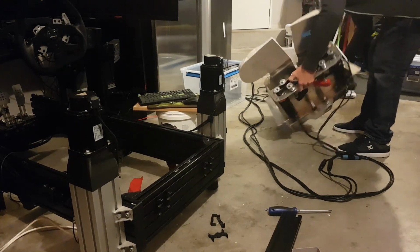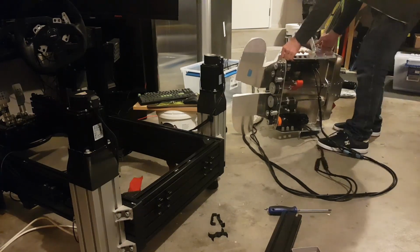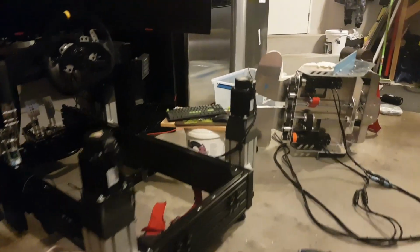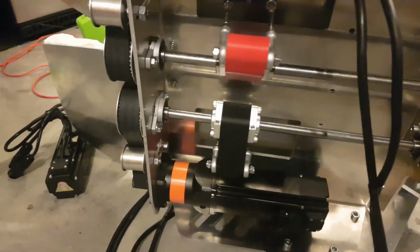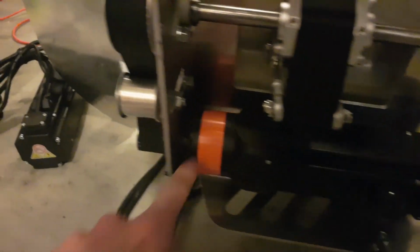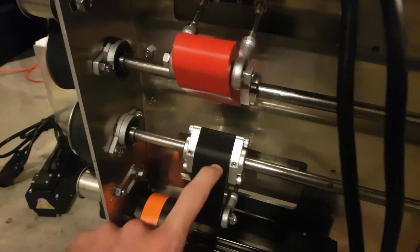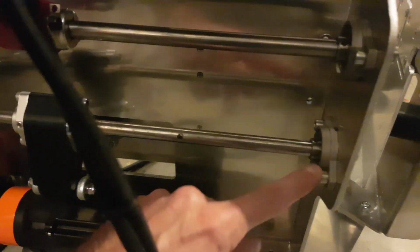So, just one outside, and then we can get to work on it. Yeah, that gets all nice and open. What we're going to do, we'll take this up. Steer this up a little bit. So here's the underside of the mechanics. We've got servo, gearbox, pinion, 2 idlers, then we've got the main pulley, goes through the shaft, onto this, our push rod, and then the bearings at the end.